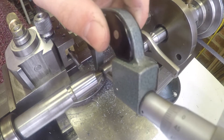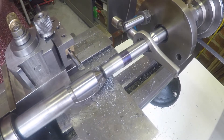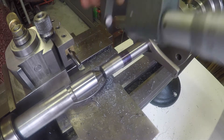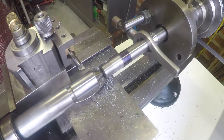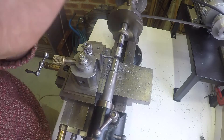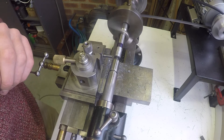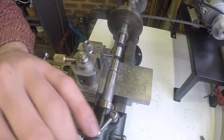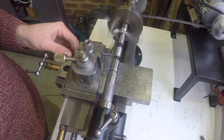Just taking a quick measurement with the micrometer here just to determine the angle of the taper. We've got a 10.96mm small diameter and an 11.43mm large diameter. This only leaves us with a change in size of 0.47mm, and it needs to be approximately 1.25mm across the length of the taper. So for these cuts I have increased the cutting angle.